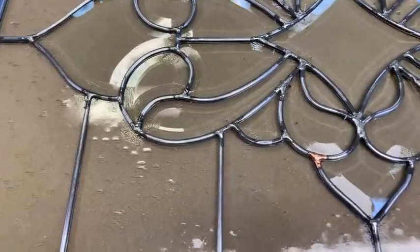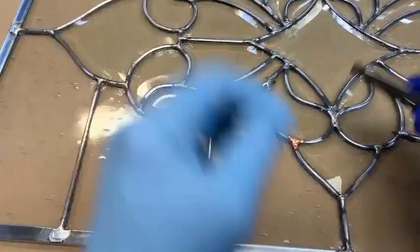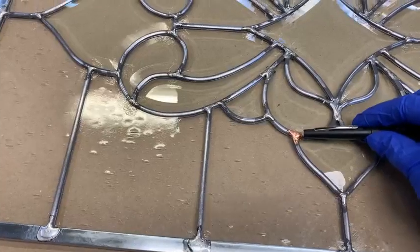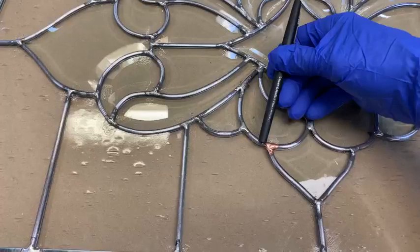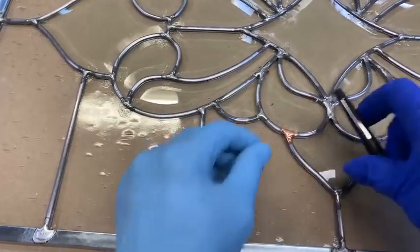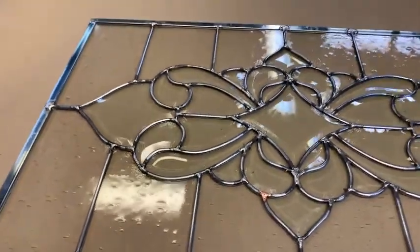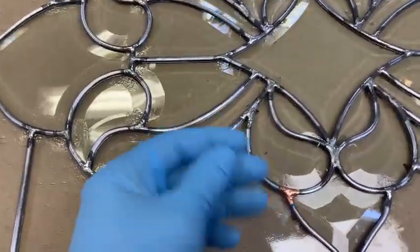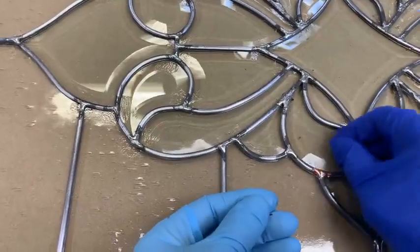And then, if you come down on this foil with your soldering iron right off, it'll want to lift up. So just put a little solder right on this edge right here, and that's going to hold that side down. Then a little more solder on this side, that'll hold it down there, and then over here. And then just coat that area with solder, and you're done. Look how fast that was. And I'm using 3/16 lead, so 3/16 foil will fit right on it.